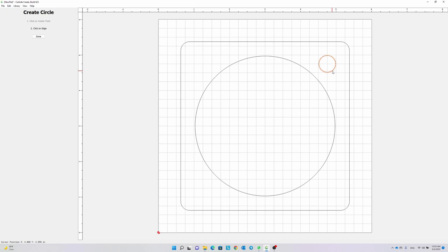Then I need a circle inside of this square. The circle needs to be carved out, so the ashtray insert sits inside of it. I figured that a 1.97 inch radius would be the best fit for my insert. I need to pocket 2 small circles with a radius of 0.2 inches in 2 opposite corners. These circles are for magnets to hold the top and bottom together.